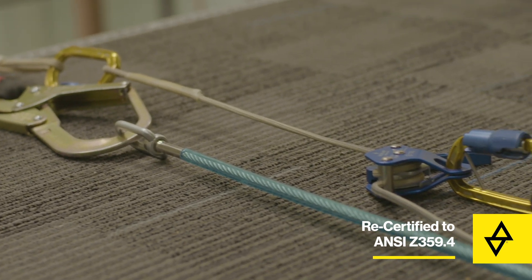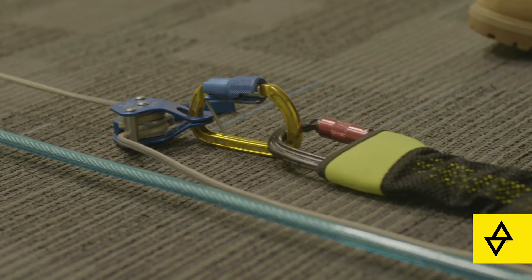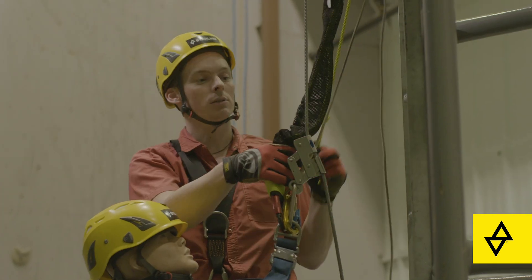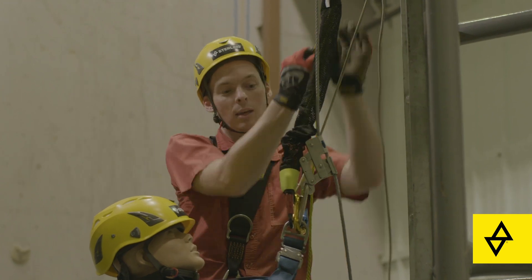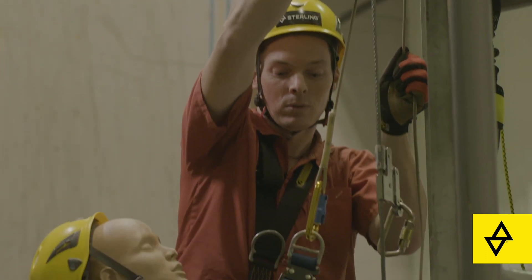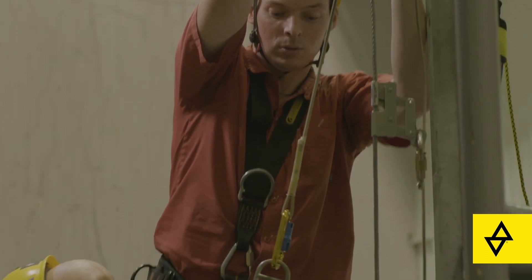The system allows you to perform three different types of rescues. The most basic one is a self-evacuation, where we're anchoring one end of the system and repelling down to safety. By adding what we call the raise and rescue kit on top of that, you can perform two other rescues — one of which would be a ladder rescue, which allows you to raise a casualty out of their fall protection and then lower them back down to the ground, or somebody who's fallen over the edge and is hanging in their fall protection. Common scenarios would be off the top of a wind turbine nacelle or somebody who's fallen off a catwalk.